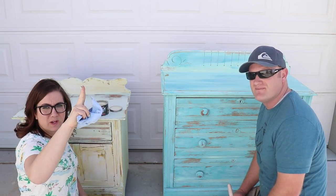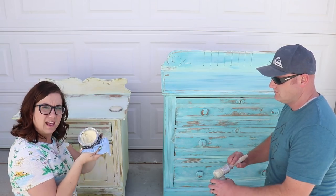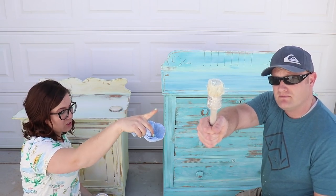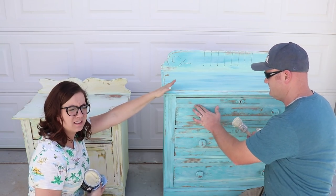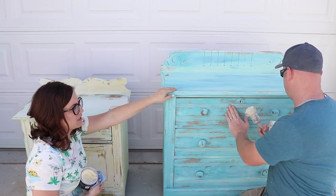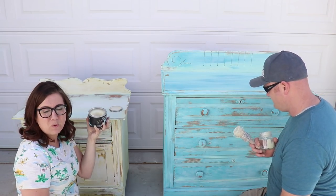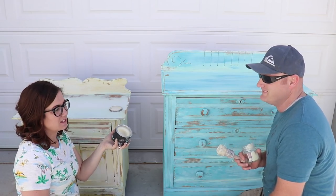So we're going to have two different ways of waxing. One is I'm using the lint-free rag with my wax. I did make sure that all the sanding dust is off of my piece. Zep's using the wax brush and he's using wax in a dish, because there's still a little bit of sand left on that piece and I don't want sand all throughout my wax. Also good to know: when you're painting something that's super chippy with milk paint and you're waxing it, I would suggest separating it out.